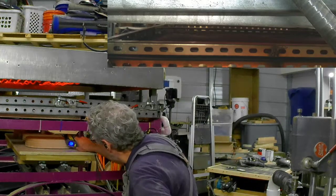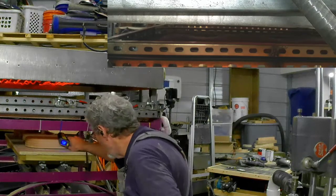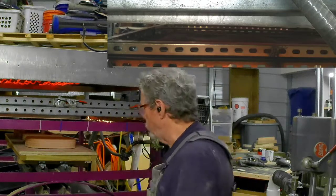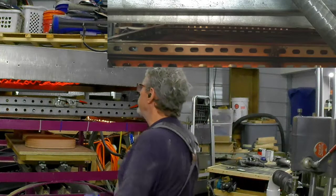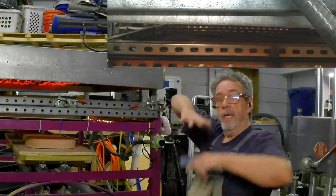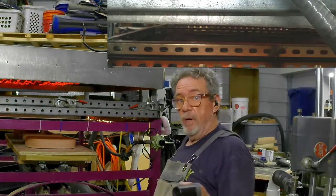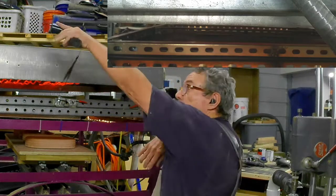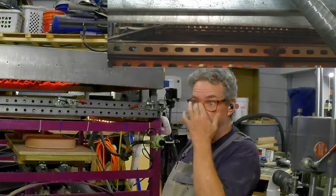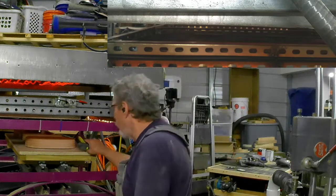I shoot the plastic from the bottom to get my temperatures. 179.5. So we're going to get it on up to about 260 and try not to scorch it if we can help it. Now it just released and dropped. When I looked in, it just dropped down and did the release. Now if you want to see a video about how this works, on my YouTube there's one where I got like four angles of when this thing does the part and makes it. So you can see how it does, but it's making a gold prospecting part, not one of these, okay? Not a guitar.